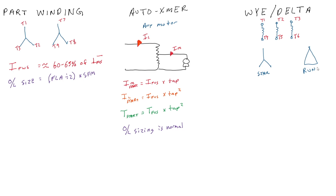My current at start when using the wye-delta starter is equal to the full voltage starting current divided by three. So it drops by 66.6% — it is only one third of the starting current, which is a huge reduction in inrush current. Unfortunately, I also see that same reduction in torque: my starting torque is my full voltage starting torque divided by three.